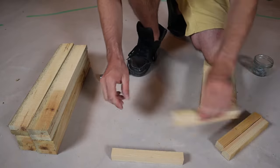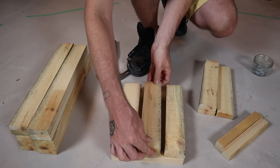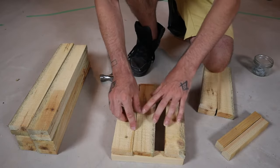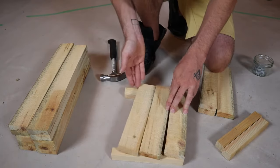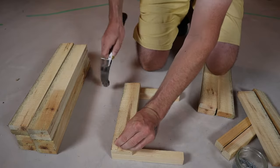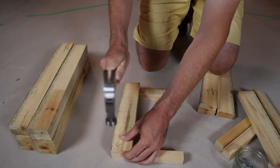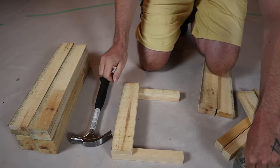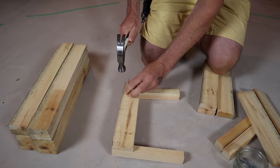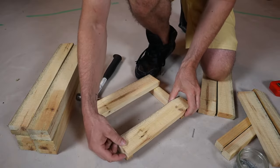How I'm going to go about building this is we're going to build the ends first. We'll get the ends nailed on like this, nice and even. Since I'm not doing the handle, I'll probably do a bigger offset here so there is a grip like this. Then we'll get the two ends nailed up and then we'll put the bottom and the sides on. I'm using inch and a half finishing nails so you don't end up with too much of a nail head sticking out. I'm going to do one nail for each end of each piece so I can tweak it around at the end if it needs to be squared up.